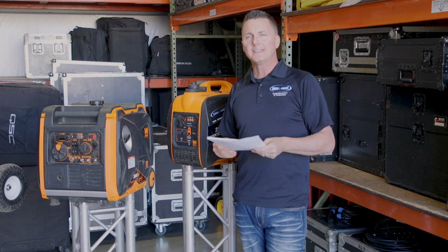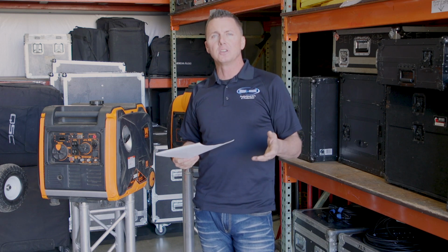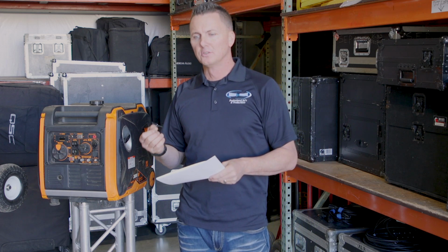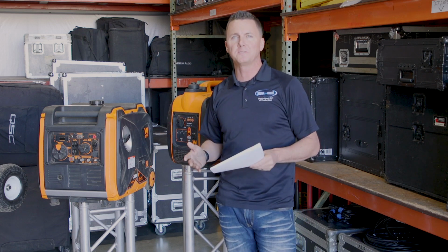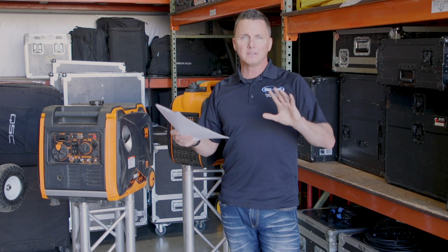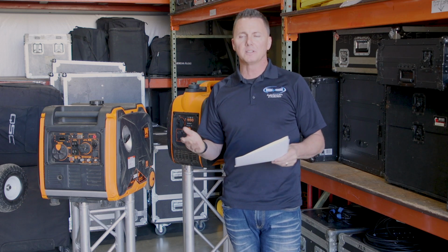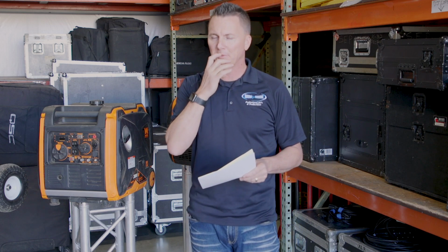Now remember, with this wattage, say you have a 2,000-watt speaker, that doesn't mean you need a 2,000-watt generator. A 2,000-watt speaker means that's what the amplifier in that speaker is producing, not what it's needing to power it. Usually your speakers will say that it draws 3 amps, things like that. So 2,400 watts is usually 20 amps. A 20 amp breaker is typically rated for about 2,400 watts. So if this is rated at 1,800 watts, I would just factor these 2,000 watts, I usually figure them out to be about a 15 amp size. That's just my opinion and what I base our load ratings on. So if you're running a couple QSC cabinets, and don't hold me to this, but I think they're around 2.5 amps, you can easily run 4 of these, 3 amps or something like that.